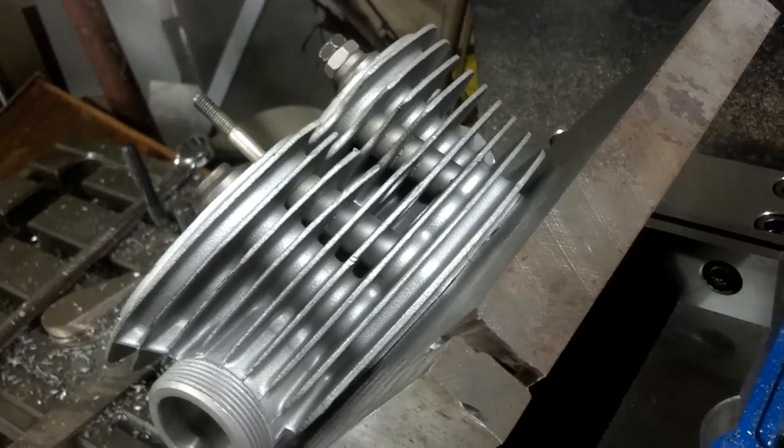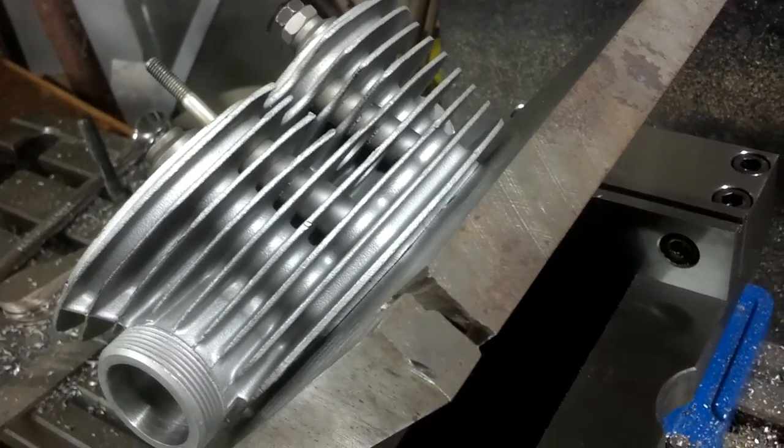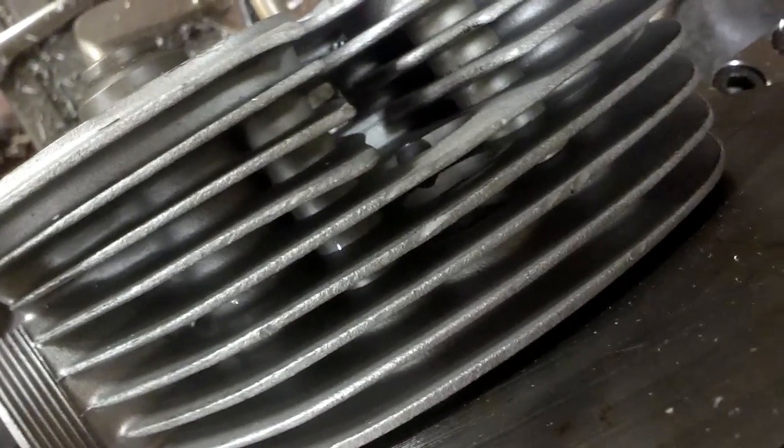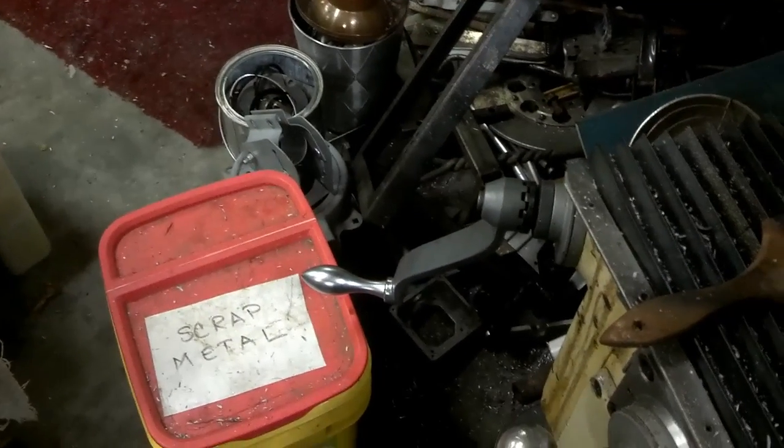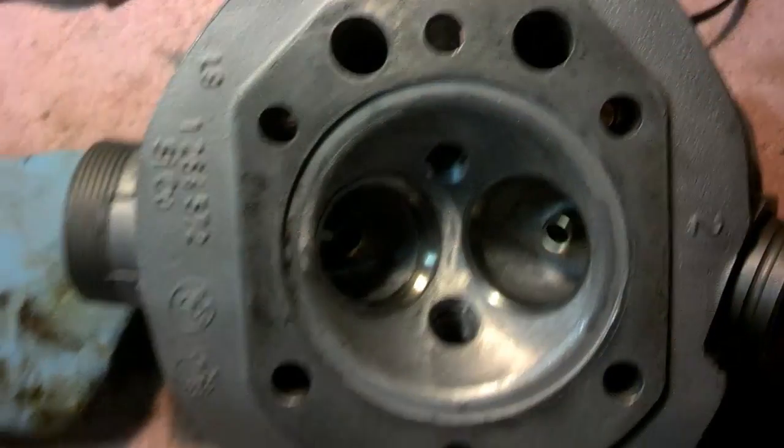You could also use a half-inch end mill to do this. I just happen to have a really good half-inch drill bit that I only use for aluminum so it stays sharp, for operations such as this. We're going to pilot the hole and then use the spot facer to give the drill a place to start. Once that's accomplished with a half-inch hole, we can tell how big we have to make our spot face. WD-40 is your friend on this because otherwise the end mill will have trouble clearing chips when it's way down in there — so just use WD-40 on it. I was running at about 1,000 RPM, which seems about right.